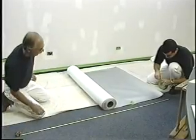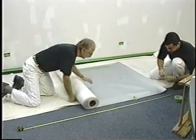Remember, each seam will be double cut, so add 2 to 3 inches of extra material on each piece at seam locations. Although we will start hanging the top piece first, the first seam is the one used to get your other seam locations. Now let's return to the wall talkers you've already unpacked.